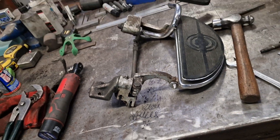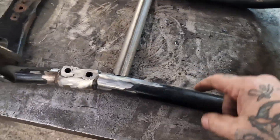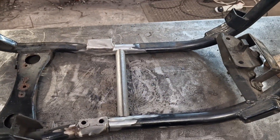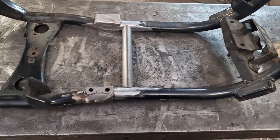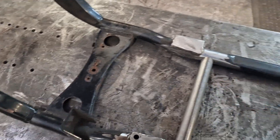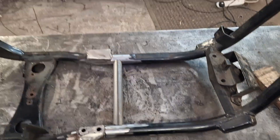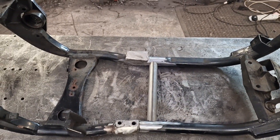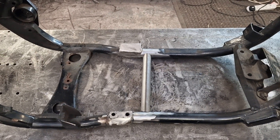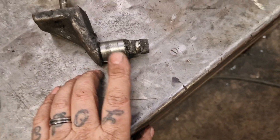In the meantime I can clean the frame rails again with my cleanup disc and put a new cross member in just in front of this - that'll leave room to get the oil lines out from the sump. Then we can turn attention to shortening this structure by an inch and a quarter. Here's the new cross member - standard frame tube, inch and eighth. That drop in size is not detrimental at all because it gives us room for the sump of the shovel engine and to clear the oil ways.